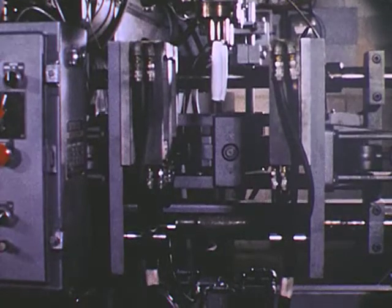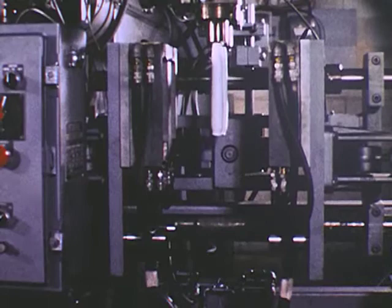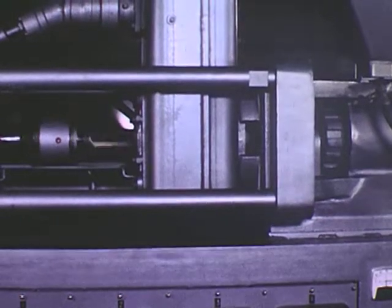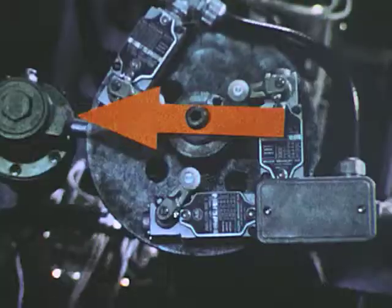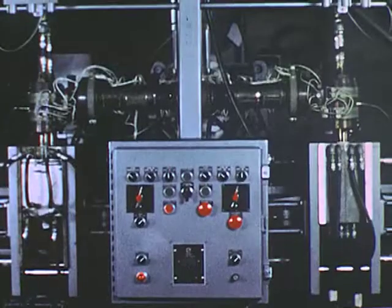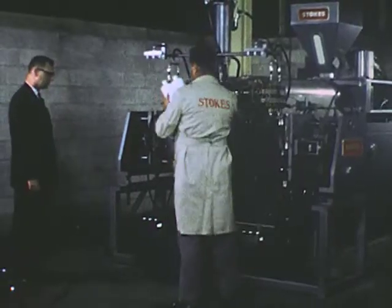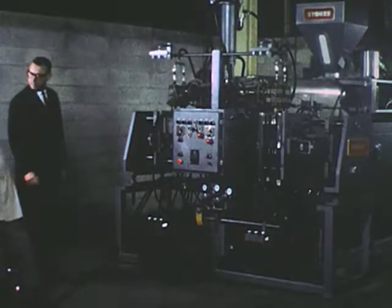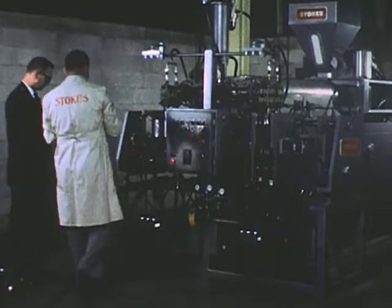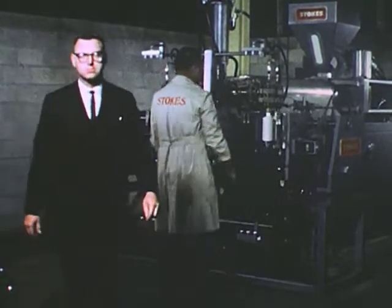As an illustration of the effectiveness of the inline accumulator, we're demonstrating the standard rate of extrusion from a two-and-a-half-inch extruder. Now observe what the reciprocating screw extruder adds to blow molding production. Rapid parison delivery reduces necking down, thus improving product quality and reducing mold open time. Inline construction has eliminated the need for thrust bearings, and with this new Stokes unit, all of the advantages of an accumulator without the disadvantages are available through the unimpeded linear flow of plasticized material.